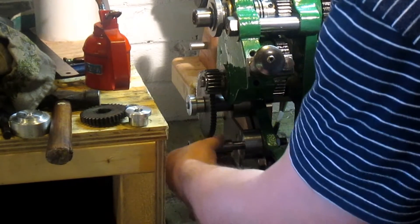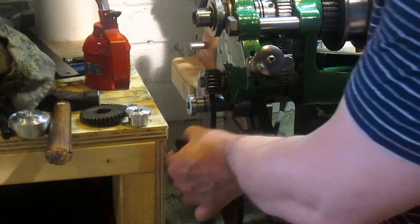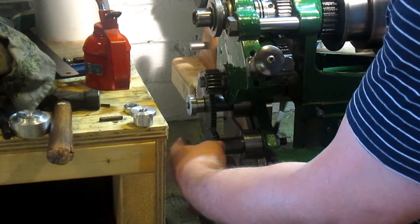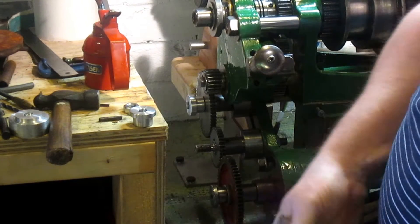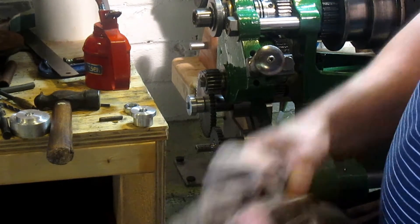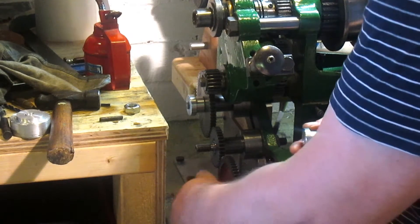What I've got on this one is... the stud itself is half inch, then I've got a sleeve on it that brings it up to 3/4. Then there's a spacer that goes over the 3/4 to give it a shoulder for the change gear to run against. That one rotates, and I've got to put a keyway on the sleeve inside so when I'm running compound gears I can get them to link together. This is just making up a representation of what was on the end of the lead screw.